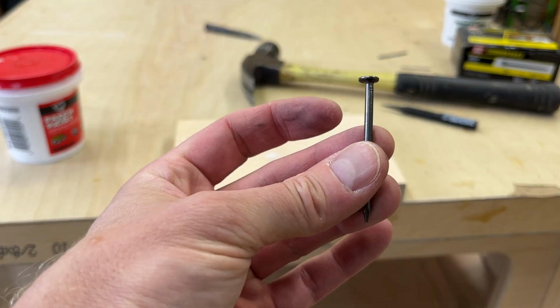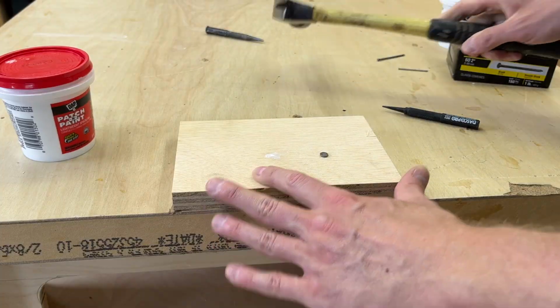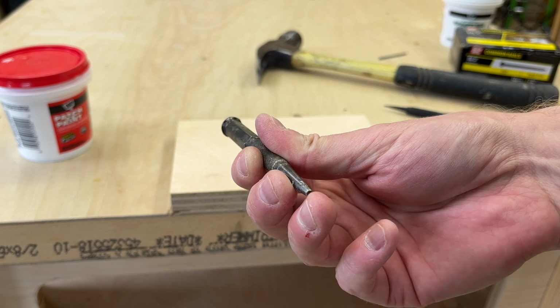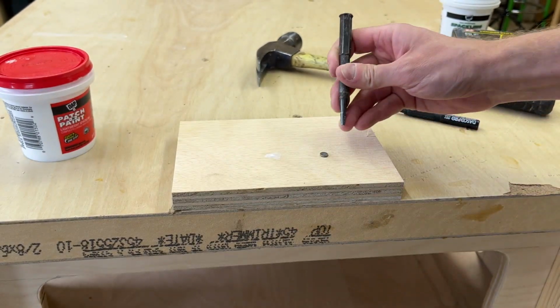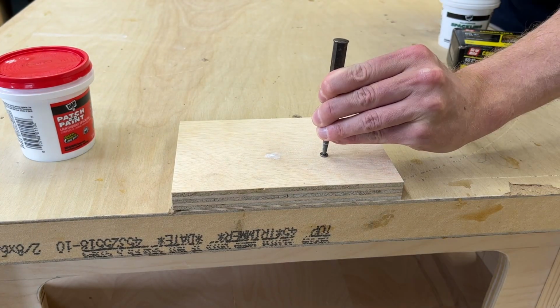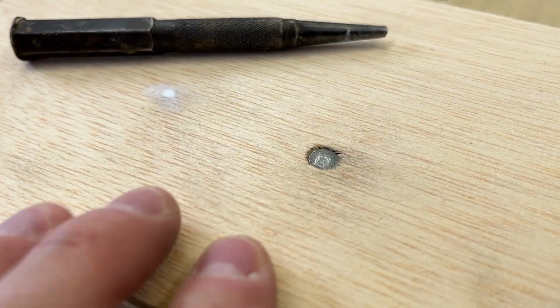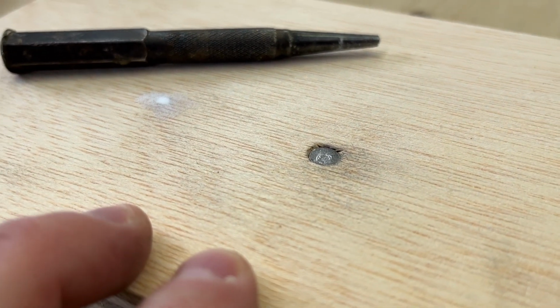The one area where they don't work as well as classic nail sets is driving down wider fasteners. Every now and then, you need to countersink a framing nail or common nail for some reason. The spring loads don't quite have the force for this. I'll still use my blunt nail set in this case. Just carefully align it in the center of the fastener and give it a couple really hard knocks from your hammer. Most fasteners will sink under this pressure. Problem fixed.